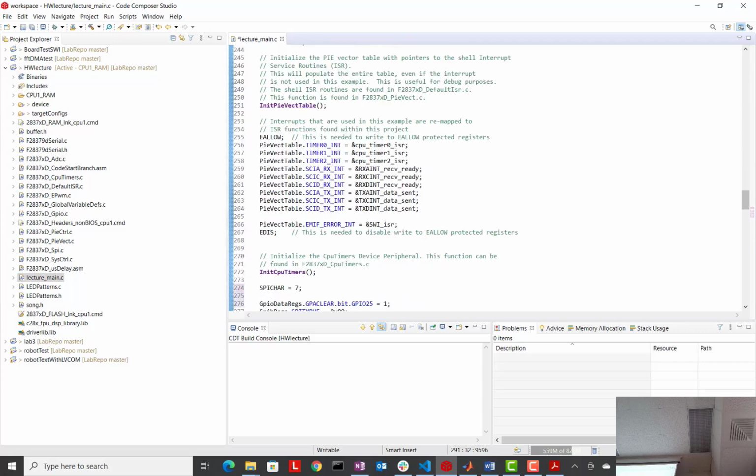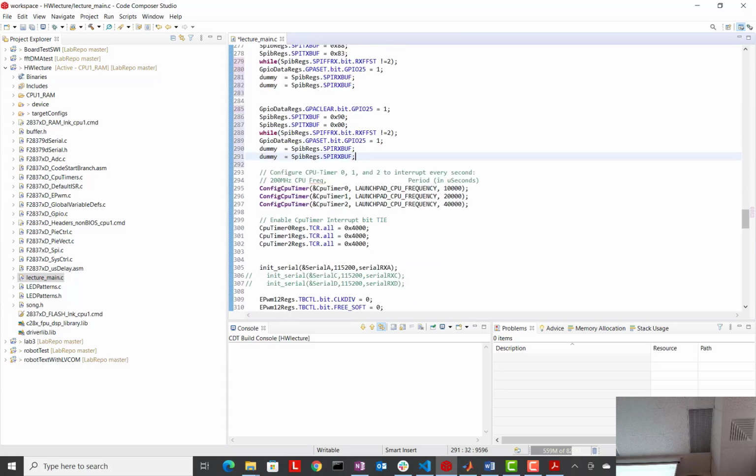For this LS7366 chip, get the right code, just so if you do double check me, I got the right thing. Yes. So, oh yeah, interesting. I'm not going to get to this, but anyway, I forgot one little minor point here, but that's okay. There's some bit shifting that needs to be done, but we're not going to worry about this for the example because we're going to be sending the full 16 bits when we get to the MPU 9250.